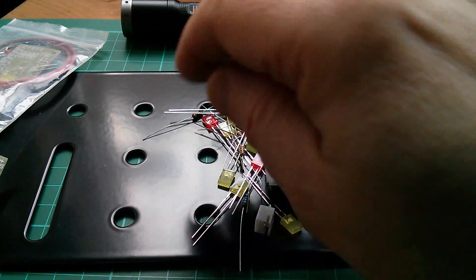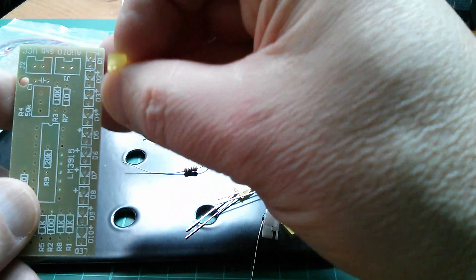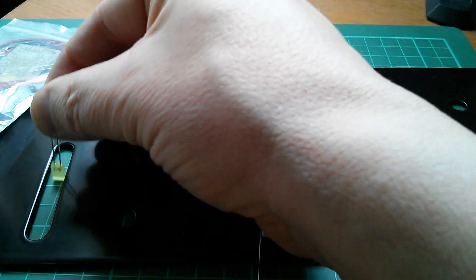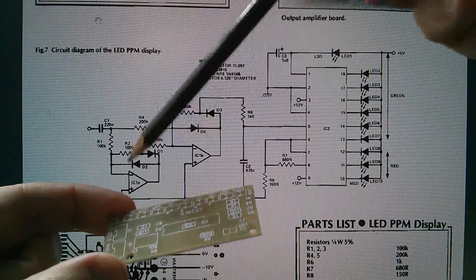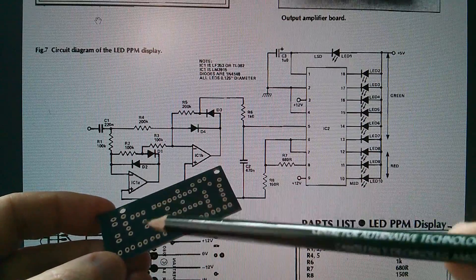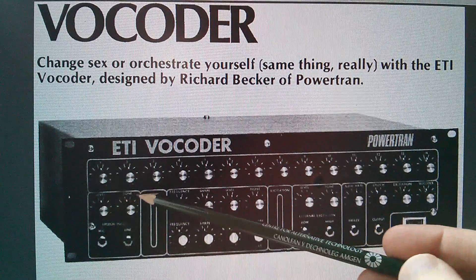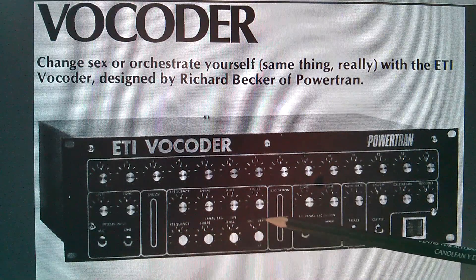The reason I cut these slots this size was because this was the only punch on the punching machine that had roughly this shape. But I figured that if I attach these LEDs to the board with them tipped sideways and sort of bent in a bit, I can shorten the bar graph — have the LEDs stacked horizontally — so they fit within that slot with all LEDs lined up. There may be a few component changes needed, and I'm going to have to add in this dual op amp, possibly dead bug style, glued on the back with wires run to the various points on the little circuit board. There are two LED bar graphs on the front panel: one for speech input level and the other for the excitation circuitry.